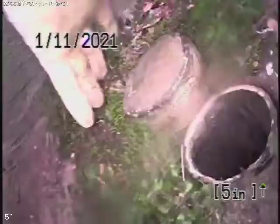We've run our camera from the clean out in the front. We just cannot get past that last little root — it's in an awkward position — but you can see the water's flowing very well, it's not backing up. Although we cannot fully check the city connection, we can tell you it's definitely flowing very well. We're going to recommend a hydro jetting so we can have a better look at the end of the line. My gut feeling tells me it's probably okay.